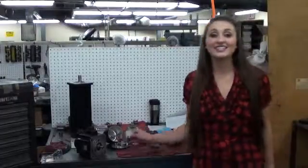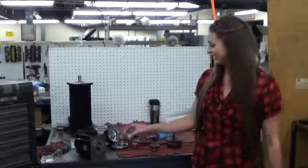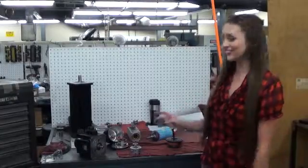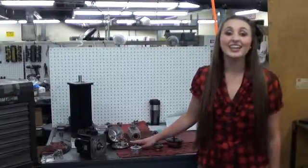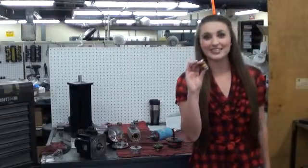Here is what you are likely to find in a typical servo motor. This is an encoder which reads thousands of lines per single revolution. This is a tach generator rotor that has been rewound and is ready to go. This is an electromechanical brake which is common in many servo motors. Here is a resolver stator, and this cute little rotor goes inside.